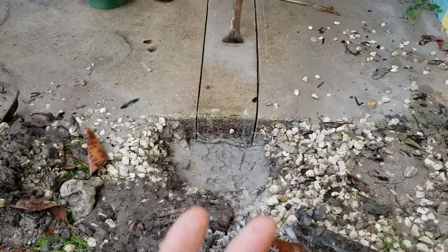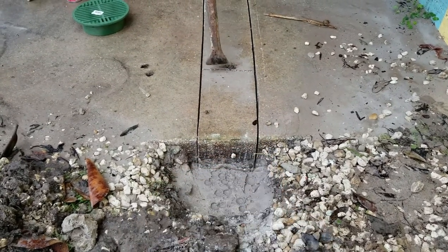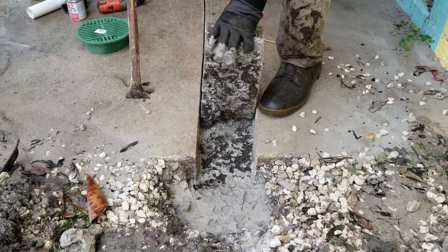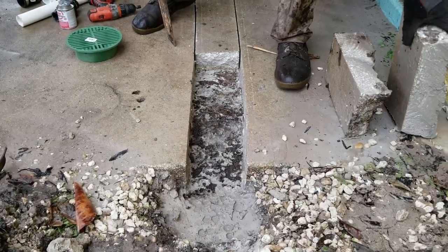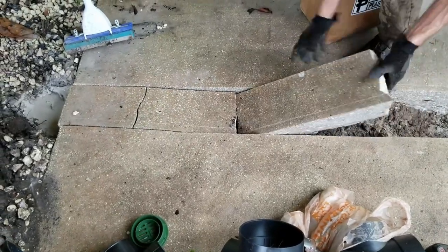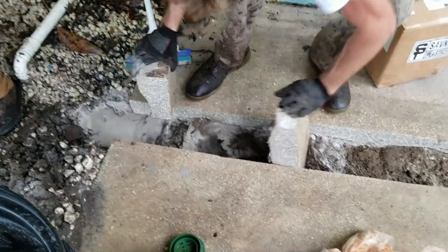The secret is to use a pry bar instead of a sledgehammer — just start hitting it on the same place over and over. See how quickly that cracked? Go ahead and pry that piece up and pull it out. It just comes right out of there — one guy with a pry bar. The secret is to cut clear through the concrete. He's already got the next crack — you can see it just lifts right out. We'll haul that concrete away and continue this process. Remember: if you do not cut clear through the concrete, you cannot do this — you'll have to beat the heck out of it and you will be tired.